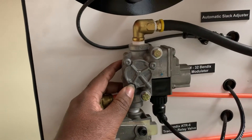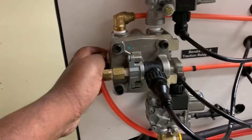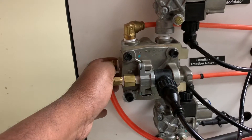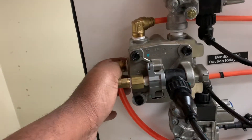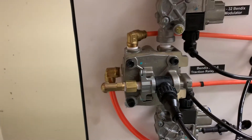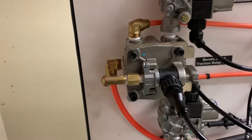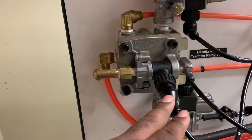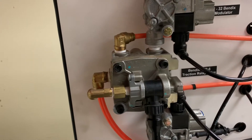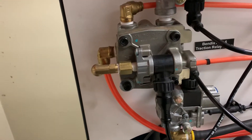So the ATR6 is not any different from my R12 or R14 valve in its lower-end function, or really from most any other service air brake relay valve in general — it's not much different in its functionality below the cover. The biggest thing is the cover and the ability for our ABS computer to actuate a solenoid, let air come in, and then provide air to our modulator valve so we can modulate air pressure into our air brake chambers. I will attach the information sheet from Bendix about the ATR6 valve in the description.